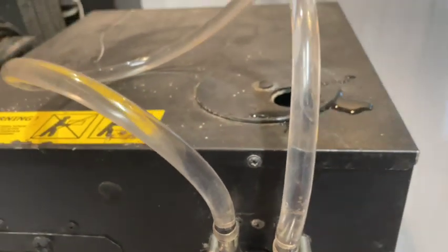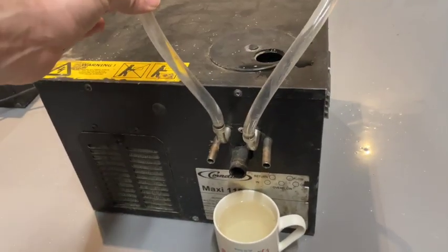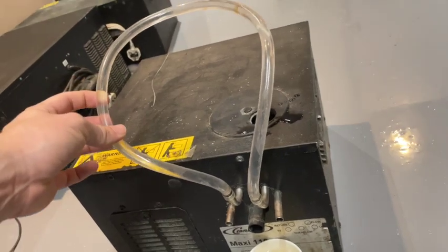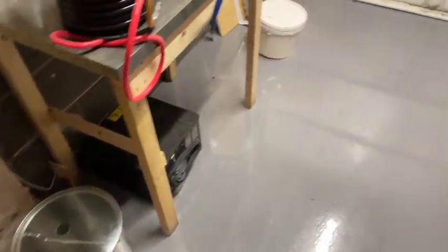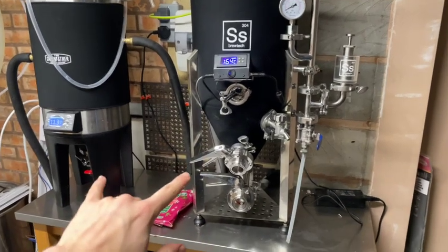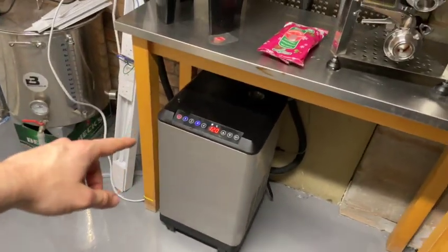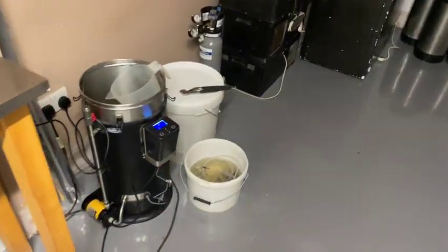Trying to see the air circulating around. These are typically used in pubs - this is what will go up to the tower that serves the beer and help keep all the beer in the line nice and cold. I've walked through the kegerator and I've set my glycol chiller back up to start cooling these tanks, because two lagers are both in the conditioning phase. Because of the work obviously I had to take them out, but I've got the glycol chiller set up and running again, connected to the tanks, so that's all going along now.